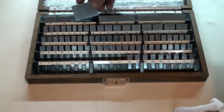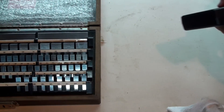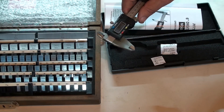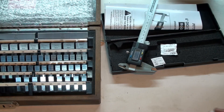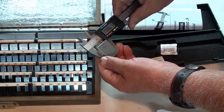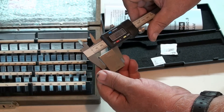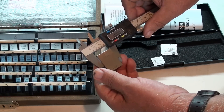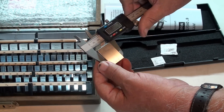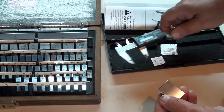What I wanted to do was just test a couple of these instruments. So let's take the cheap one. This is the digital caliper — the Pittsburgh from Harbor Freight, the generic home brand. We're measuring one inch. You can see it's measuring within half a thou — alternating between one thou and half a thou. So it's measuring within five ten-thousandths of an inch. For home use, someone not looking for absolute accuracy, that's probably good enough. But this is not something you would use in a tool room — you'd want much higher accuracy.